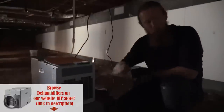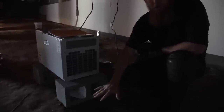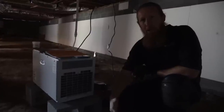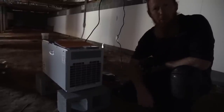We're going to trench and sump pump this crawlspace because they have some standing water coming in. We're also going to put down an underlayment — that's our platinum package with a lifetime warranty. We're going to do the platinum encapsulation: the underlayment, the 12-mil vapor barrier on top, the trench with easy flow all the way around. We're going to show you all that in later videos, so make sure you subscribe to our channel.